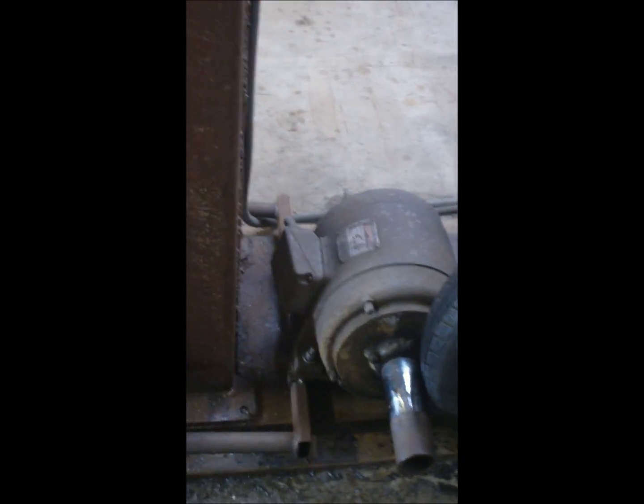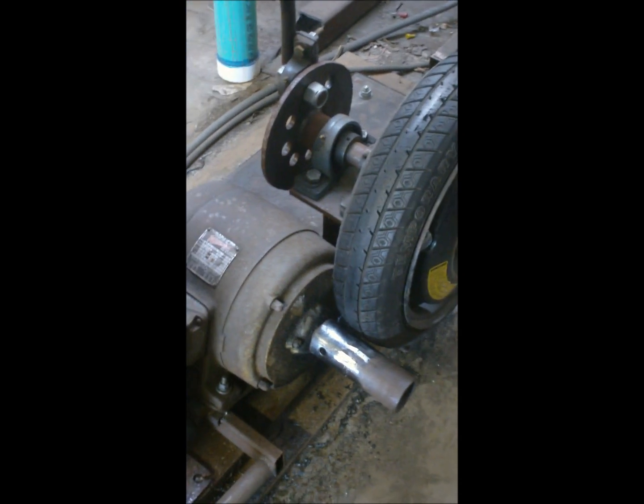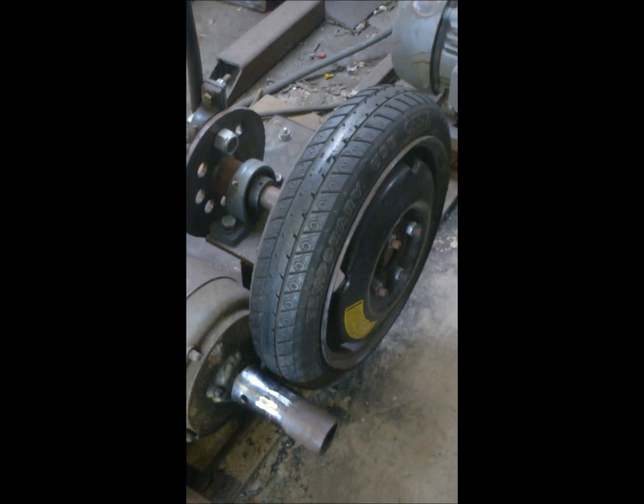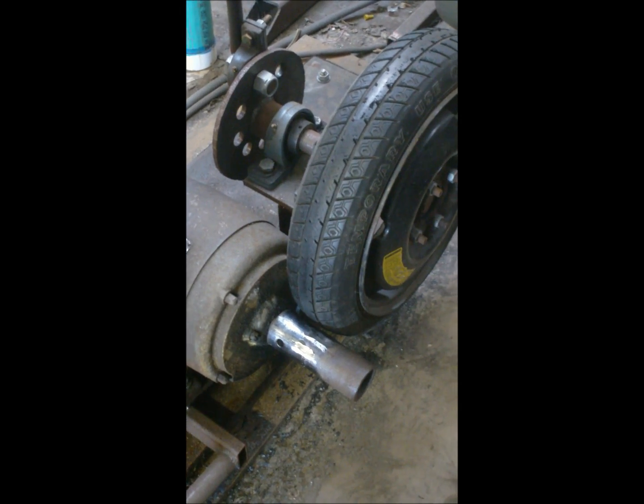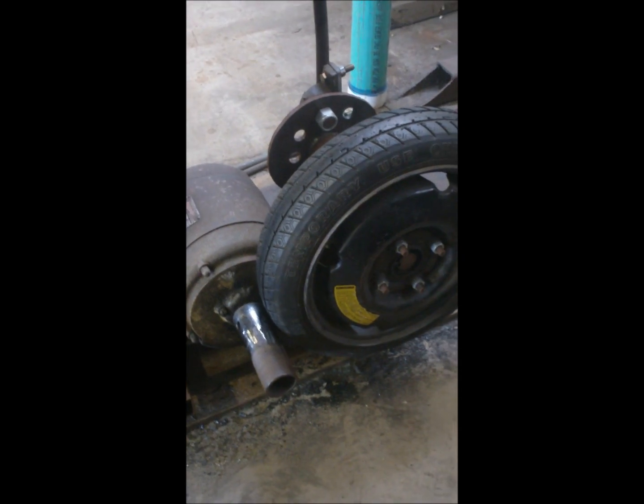The drive mechanism: the motor sits on a hinge plate. As you step on the treadle, it swings up and the wheel contacts the spare tire. As you step off, gravity pulls it back down and disengages from the tire. Very simple, very elegant, works great — no springs involved like a lot of systems have. The clutch mechanism is a tire clutch. It gives good control: the harder you step, the more power is transferred and the harder and faster the hammer hits. The softer you step, the lighter it will hit, so you can actually feather it. This has better control than a slack belt clutch.